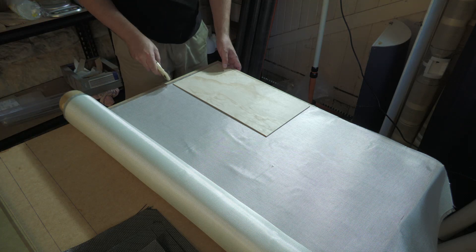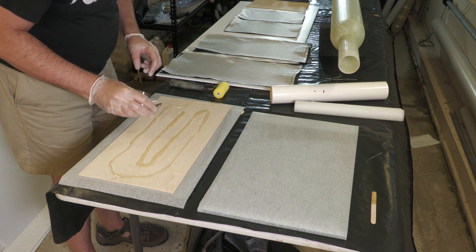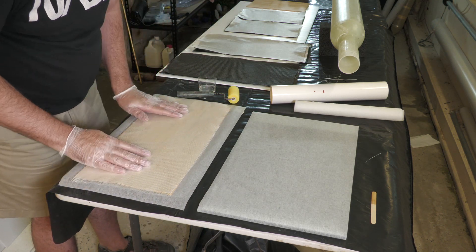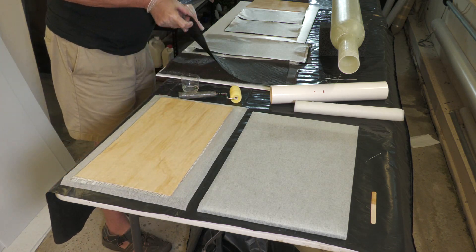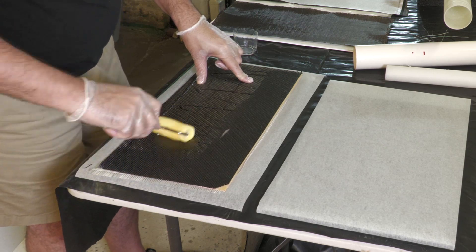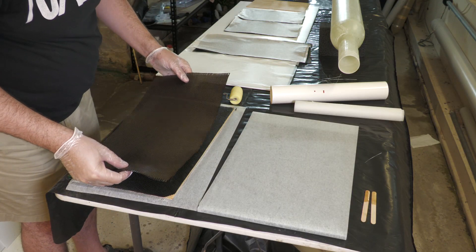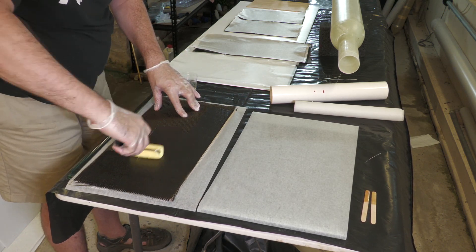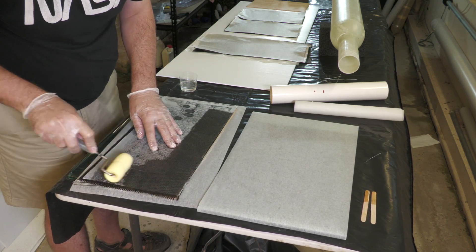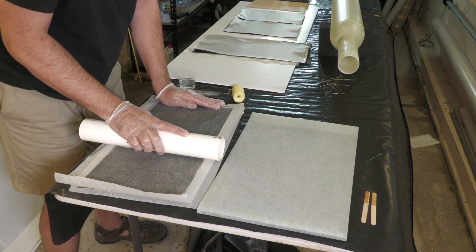We're also adding an extra couple of layers of fiberglass to save costs. The first layer is 200gsm plain weave fiberglass with fibers oriented at 0 and 90 degrees, followed by a layer of bias cut carbon fiber. We're using West Systems epoxy with the slow hardener. Next comes a 0 and 90 degree sheet of carbon fiber, and finally 85gsm bias cut fiberglass cloth for a smoother top finish. We put a sheet of baking paper on top and use a PVC pipe to squeegee out bubbles and evenly spread the epoxy.